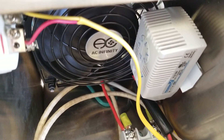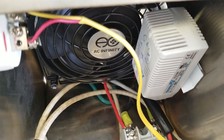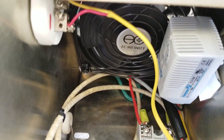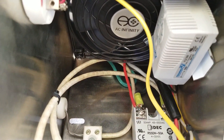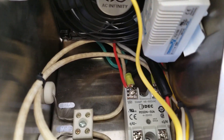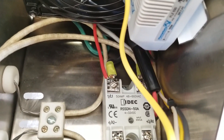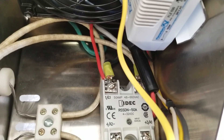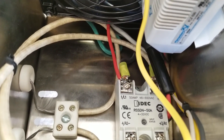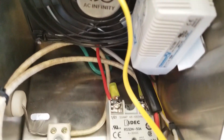The white box is the controller for the cooling fan — it's got a dial on it, currently set just below 100 degrees, about 95°F, so when the panel temperature comes up the fan will cycle. The red wire goes into a black fuse holder — that's a 10 amp fast-acting glass fuse for the controls only. It protects the temperature controller, the control section of the IDEC, and the fan — everything low amperage is on that fuse.